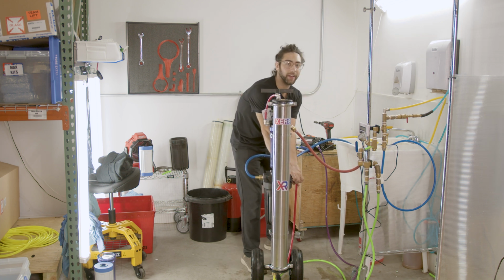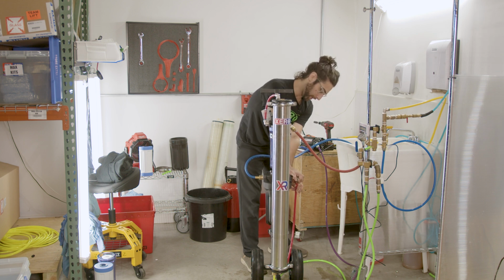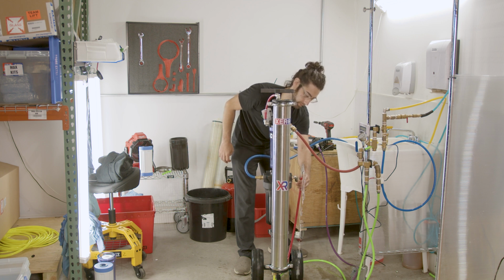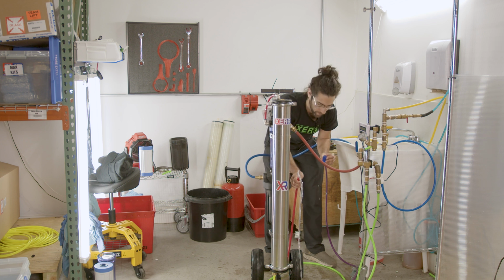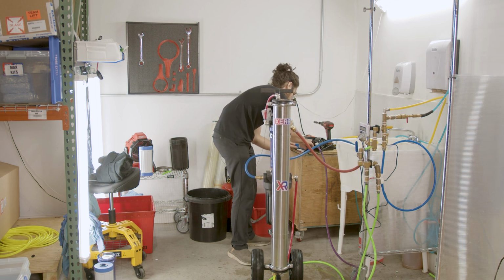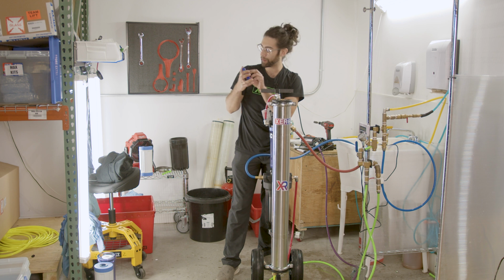Removing this hose from the DI inlet will result in a little bit of water splash. You can shut off your system to avoid getting splashed, or you can simply pull on the blue end of the push fitting and with the opposite hand pull the hose out. So now we're going to see how much of minerals have been removed from the RO membrane. We're just going to hook this back up. So from 81, brought it down to 6 ppm.